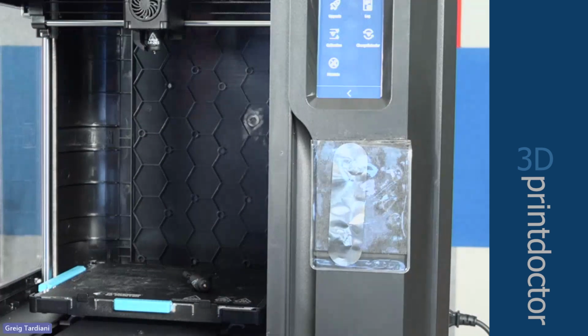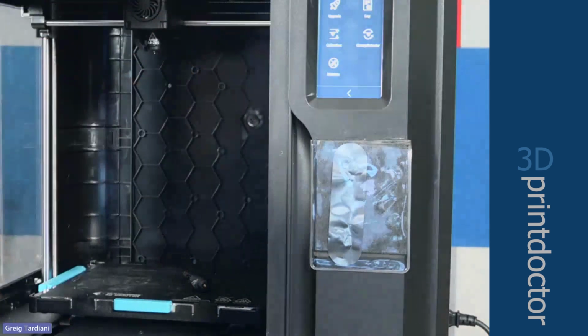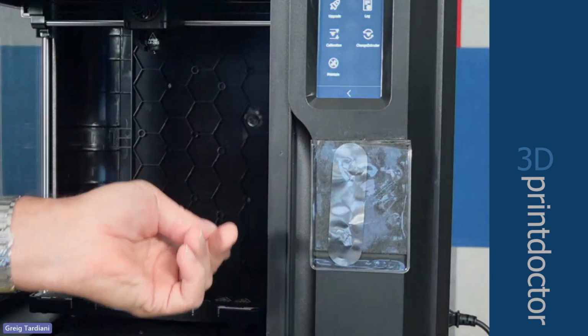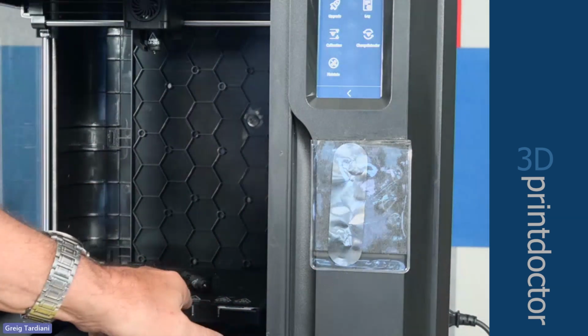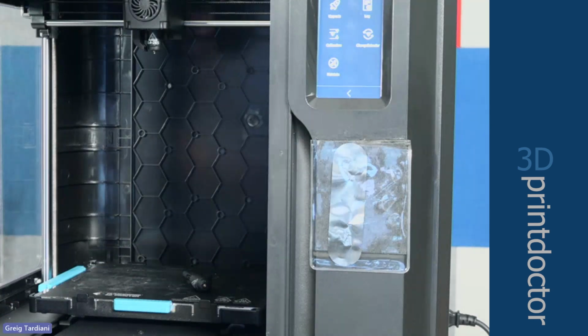It's probably a good idea, actually it's a very good idea, if you change over the nozzle, because the nozzles will have sometimes a little bit of height difference, and that's what that Z height is. It's probably quicker, but you don't know what this distance is, because it really isn't telling you anything. Do a print level at this point in time just to make sure that you've got the right distances, and you'll probably find a little bit of adjustment when you swap over the nozzle.